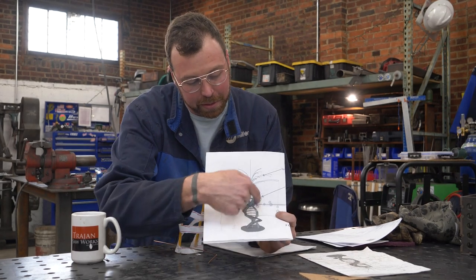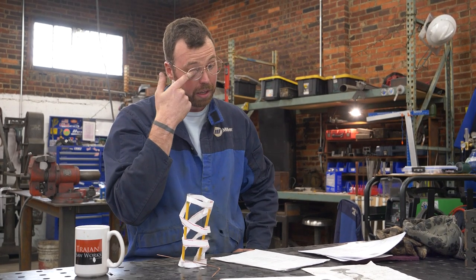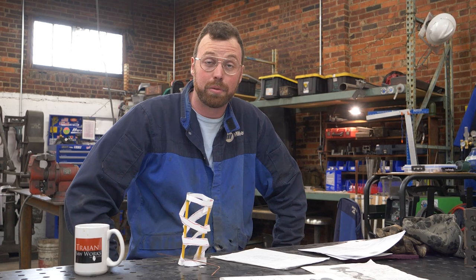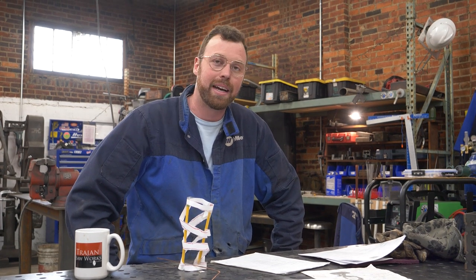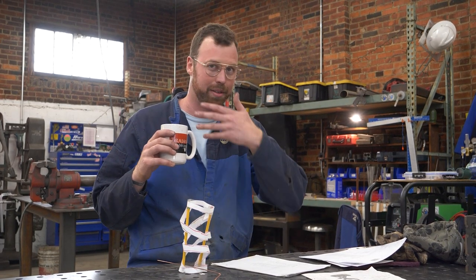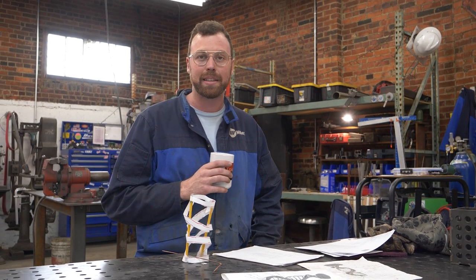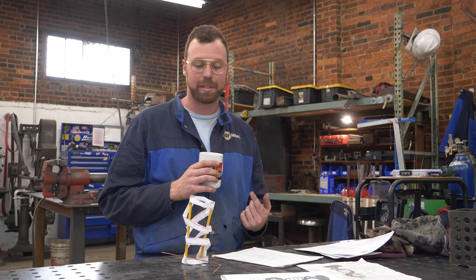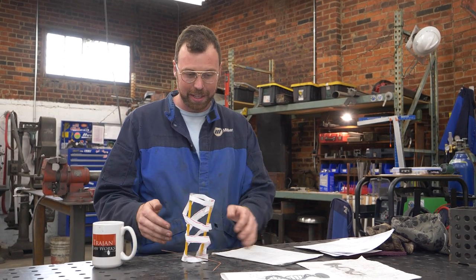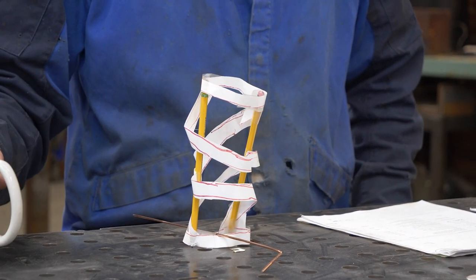This was a client of Black Dog's and they didn't have anyone on their fabrication team comfortable tackling something like this, so dad and Cam reached out to me. This is the sketch I was given — it's a little off the wall, very abstract looking, there's not a straight line on it. First thought was to take two flat pieces of flat bar and roll them into a spiral, do that twice, and you get the sides of a helix. But doing that in a slip roll is really difficult. The old guy who has a machine shop up the street just looked at me with a glazed-over look like that's never going to work — well, you're wrong. But he wasn't going to take a chance on me. So Plan B was what we did — we got a 30-inch pipe from EC Pace Company here in town, called a casing, and we cut a helix away from the cylinder.